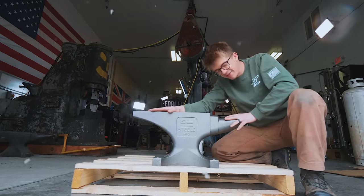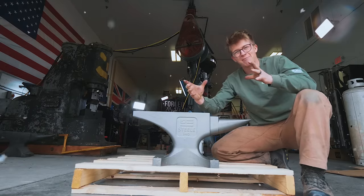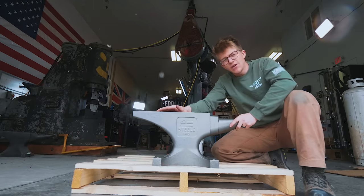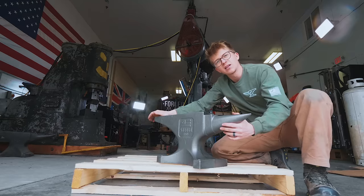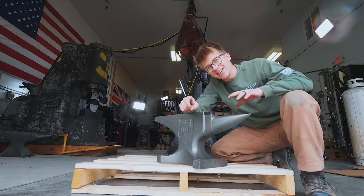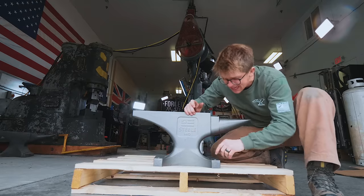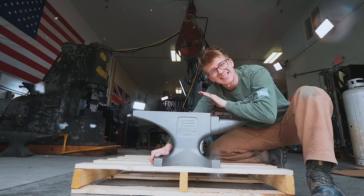This thing arrived yesterday from the foundry. We spent months working on the design. It's been a long process — the foundry made their wooden pattern, set up their sand moulds, and poured our first prototype anvil. This is a 140-pound cast steel anvil, 52 Rockwell. It has a 1-inch hardy hole, a 5/8 pritchell hole. It has all of the features I wanted in an anvil. It's 140 pounds so we can ship UPS and FedEx ground to customers, which significantly cuts down on shipping cost. The quality of this casting is incredible — the logos came out beautifully, and the proportions are exactly what we modelled.